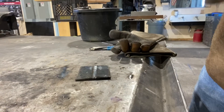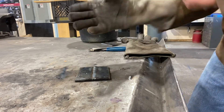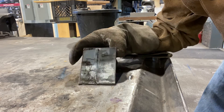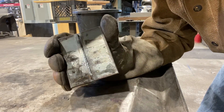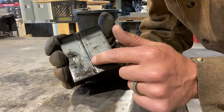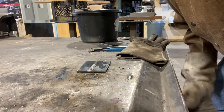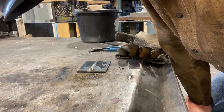As we lift up our helmets, you can see the weld. You want to keep a consistent size — about the size of a dime is what you're looking for all the way across. By keeping that consistent size and consistent heat, your weld should penetrate through the piece of metal and you should see little bits of that weld on the other side. Notice the discoloration in the metal — that's the proper sign of penetration of that weld into the metal.